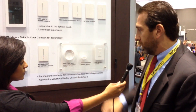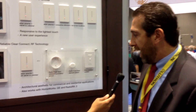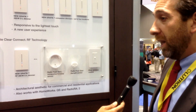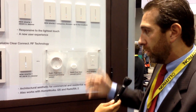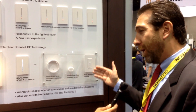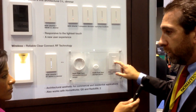We can also add a wireless control to the wall. This is a handheld Pico, but we can actually install this to the wall and mount it behind one of our face plates like this, and add wireless control where there wasn't any before. I'm communicating to that dimmer as well. So if on the other side of a conference room or an office you want to add a switch where there wasn't one, the contractor can hang this on the wall associated to this dimmer, and now you can dim and control those lights from another part of the space.